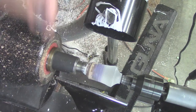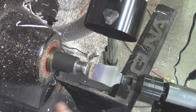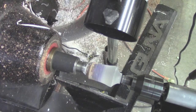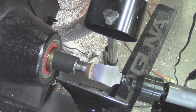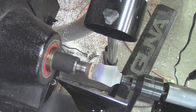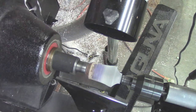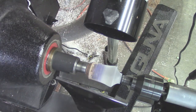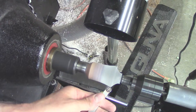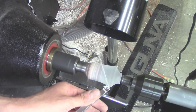Some of these shavings thrown in here. One thing, the shavings are not very, like some of the epoxies are very stringy. I'm not even sure how to explain it really. I really actually like these shavings. They don't seem to be very staticky. They're easy to rip, you know? So it's very similar to turning Alumilite clear slow set, I think, or just Alumilite clear. It's turning fine. I really didn't think that there was gonna be anything kind of weird about turning it.